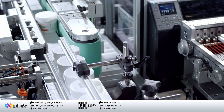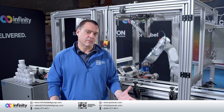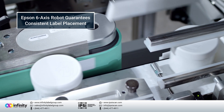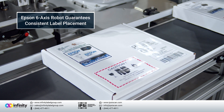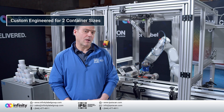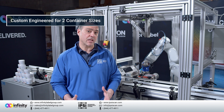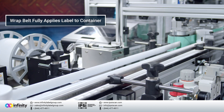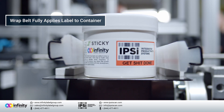We haven't seen a system like that personally — it could be the first one that exists. Key advantages of the robot system for printing and applying labels is that you can make micro-adjustments to ensure the label orientation, placement, and presentation to the container is accurate and consistent every single time. The product presentation conveyor seen here has been custom engineered to support two specific container sizes, with an easy changeover between those sizes that takes less than two minutes. After the robot applies the label, the container runs through the wrap belt unit for final application, then follows through to the outfeed conveyor for final packaging.